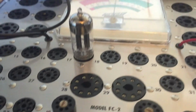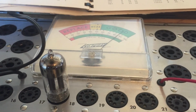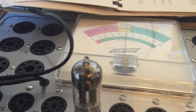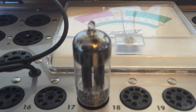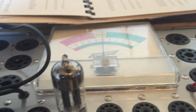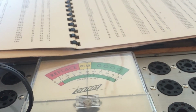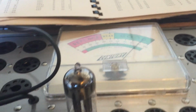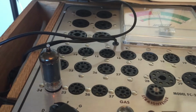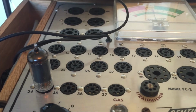Moving on. This 12AX7 also shows a slightly weak emission. Still good, just slightly weak. This did arrive with a slight chip on the tip there. Obviously did not break the vacuum. The tube still works. There is no marking on this whatsoever. This was established by pinout that this is in fact a 12AX7. Somebody tried to clean it and rubbed off all the markings on the tube, but a little weak, acceptable. Moving on. This little 6AU6A is part of the vibrato circuit.